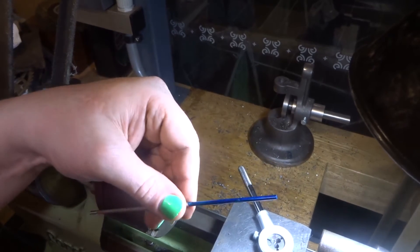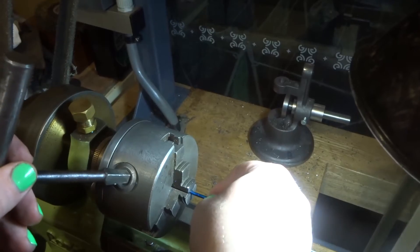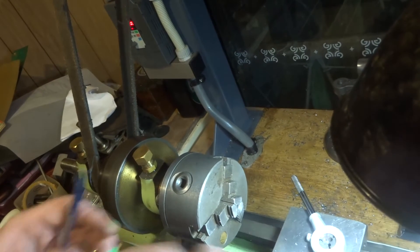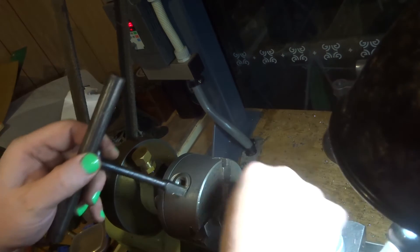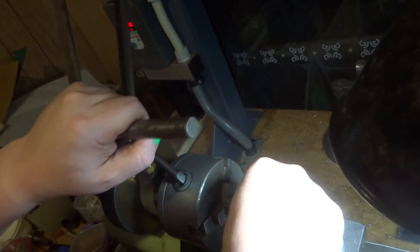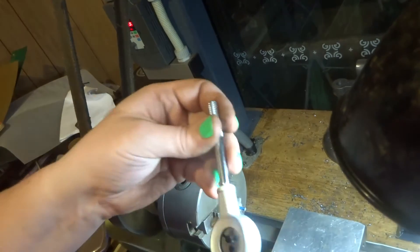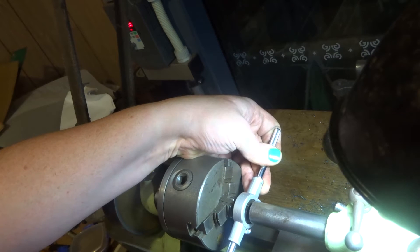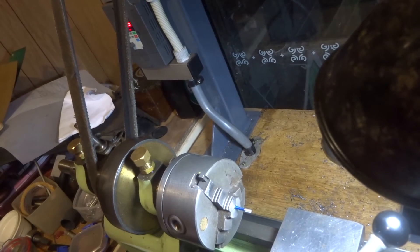So I did them in the blue bottle and marked them - they're 136mm. So they want about 12 or 14mm off the end. I've blued them, marked them, and cut them all to the same length. They don't have to be particularly critical, they've just got to look nice. And I'll tap these through each one just till it starts to show through the other side of the button die - that's about 6mm - as long as they're all the same too. And the last one, so that's some more parts done.